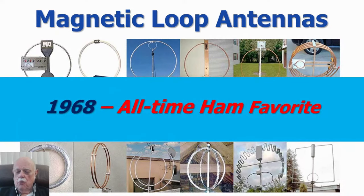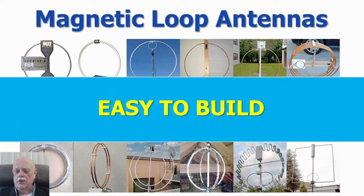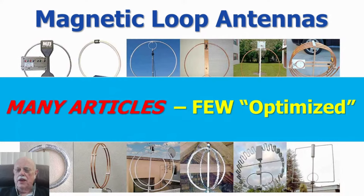The magnetic loop has been a real favorite with hams, but only since 1968, because it's a comparative newcomer into the ham radio world. Most other ham antennas date back to the 1930s, but the magnetic loop did not appear in ham radio until 1968. It's been very popular because it's small — even a little three or four foot loop can do wonderful things and compete very favorably with bigger antennas that people might have difficulty hiding in an attic or keeping away from neighbors. They're generally easy to build, mostly made out of hardware store material. And because they are new and fascinating, there are many articles — I can't believe how many there are on the internet.